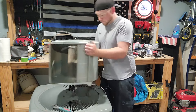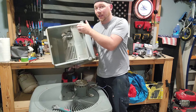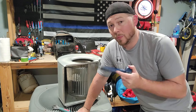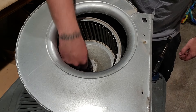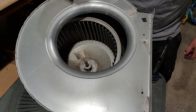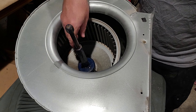I'm going to show you what happens if it doesn't come out and the shaft is a little seized. Luckily that time it wasn't seized, but if it is, I always grab my fan puller. First things first when you find yourself in that position - take the set screw out and put it in your pocket. Do not lose that.